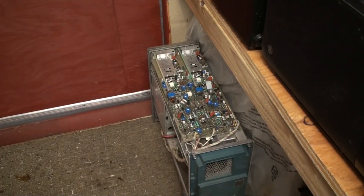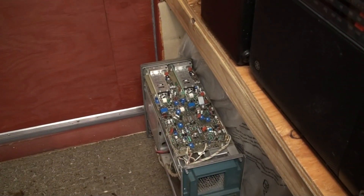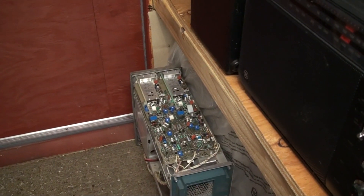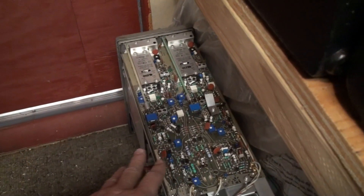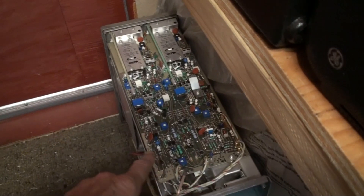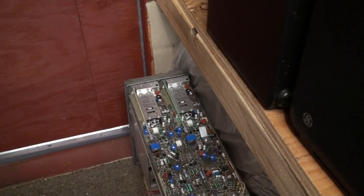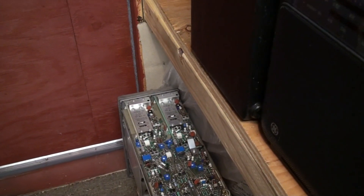A lot of you don't like these videos, but this is the scope that had the intermittent vertical amplifier circuitry, and it is not — I don't think it's the BNC — because no matter what I do on the vertical board, anywhere I touch on the vertical boards, everything jumps. I can do it way back here. I checked everything: the transistors are plugged in, there are round ICs, metal case ICs that I wiggle around, and I thought I had it, but no.